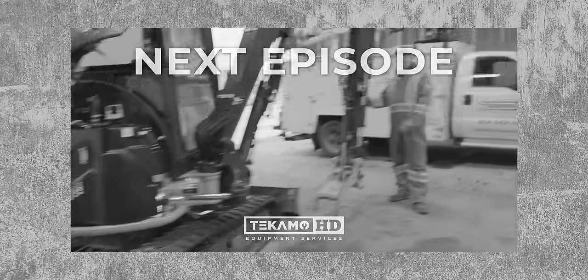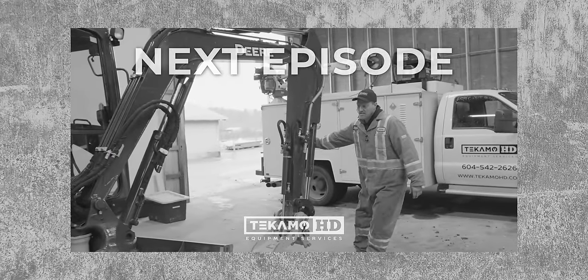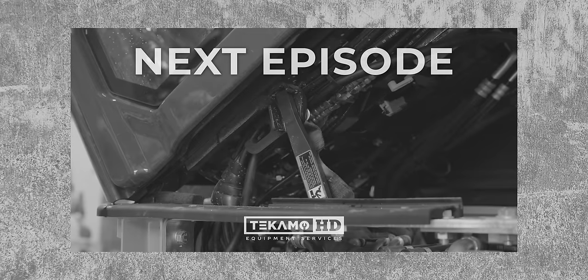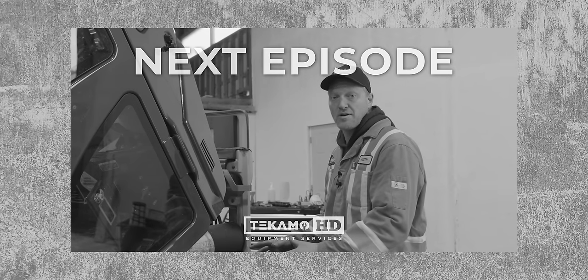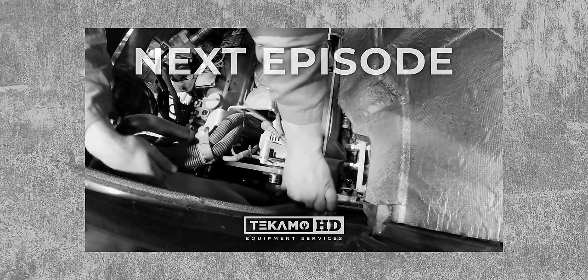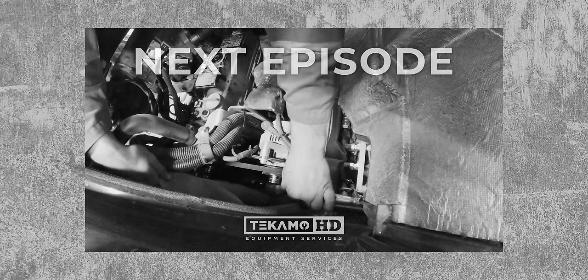So we should be able to move this by hand. I haven't tried yet, so here's the first attempt. This cab cannot come down. I can safely go in here with my body, my head, my arms, knowing that nothing can fall and I can't hurt or kill myself. And you want to spin this engine over a couple of times, and see any water that comes out of the engine or anything like that.